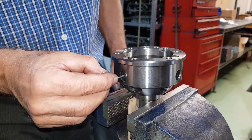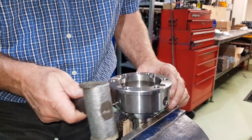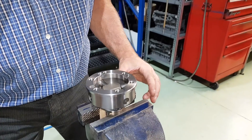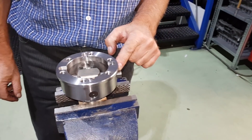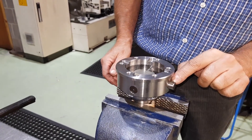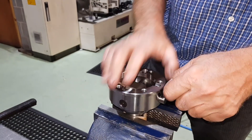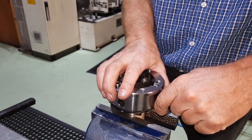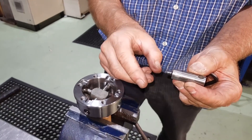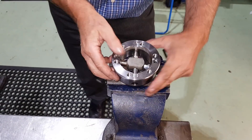All you need then is just a little tap — that's how much it needs, nothing basically. You'll find the pin on the opposite side comes out. If it's a little bit tight, don't worry, because it's got a hole where the screw goes through and you can use the Allen key to pull it out the final bit. That pin has got a location diameter which we'll go through in a moment. That's the first pin out.